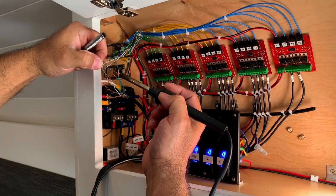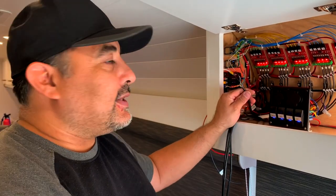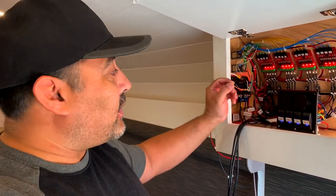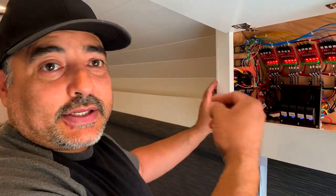Yeah. Okay. All right, so we've gone ahead and soldered these wires in. So this is for the kitchen wall plate, and it contains four switches, so we have the four wires here. In order for those switches to work, they need plus 3.3 volts, and so that will come in through the orange wire, so we'll do that a little bit later, and it will also just get snapped into one